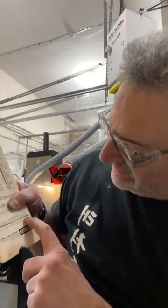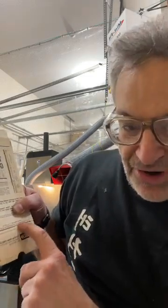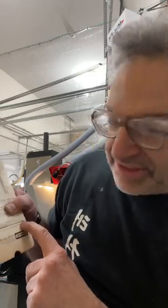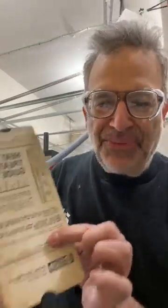And if you go down here, it says if you temper it at various temperatures you get different hardnesses. I tempered at 400, it says 60 to 62. And what did we measure? 61. So the moral of the story is, if you follow the process and your procedures are good, you have good temperature control, you have good long soak times, you basically get the recipe and follow the recipe, you get the numbers that they say you're going to get. Rockwell 61.